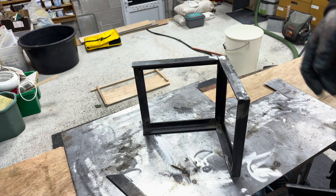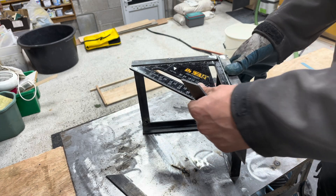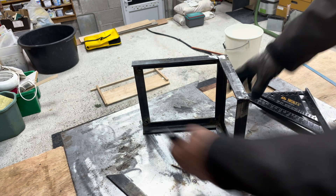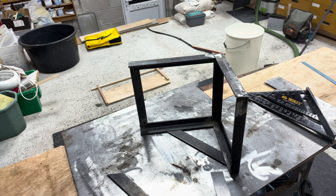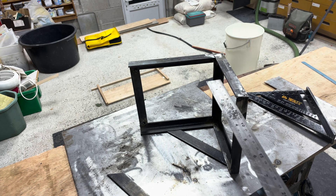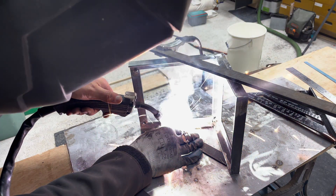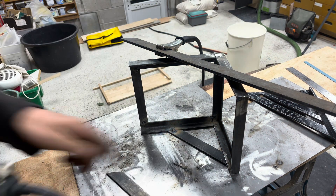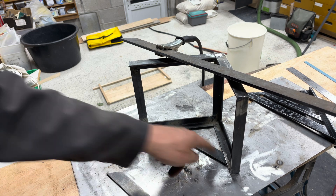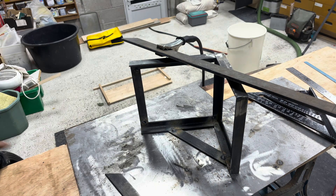I just want to make sure that the one that is out of square is done last. I'll do this one first — I know this one's square — so I'm going to pop this one in and then measure this distance here so I can mirror it up and pull the other one in square. See how that bent out of shape just from doing a weld there? It's crazy. Okay so that's welded. Now I'll measure the distance — that is 21 mil.